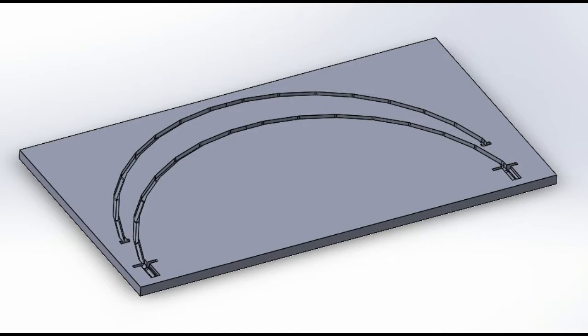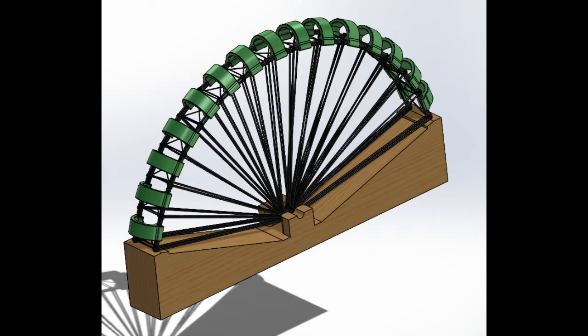The plan for the build was to CNC a mould out of HDPE to form the main arches of the bridge, and then use a lacing jig to hold those arches in position with some 3D prints and some wood while I wrapped the tension elements around it. It was quite a bit of new process for me — I've used metal tools before with composites at work but not plastic ones. I was hoping the plastic would help the epoxy release better, and I hadn't done open mould tensile elements before.